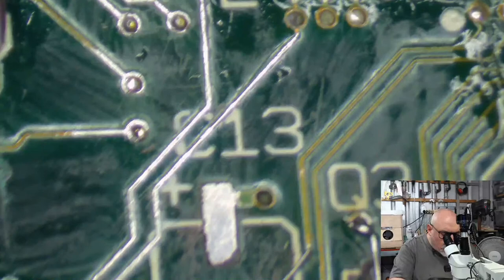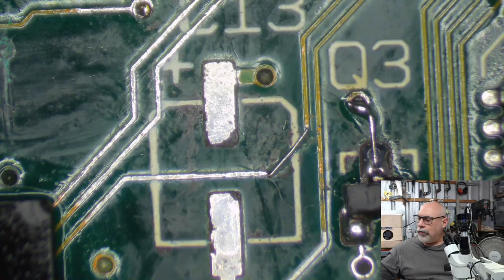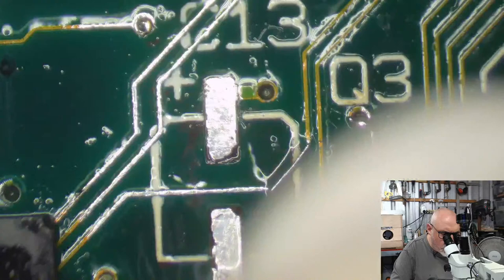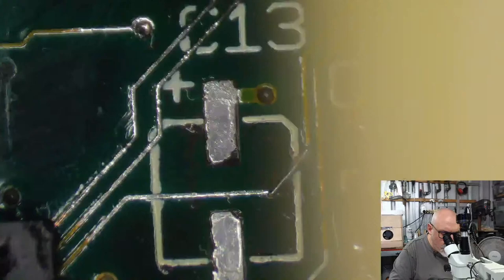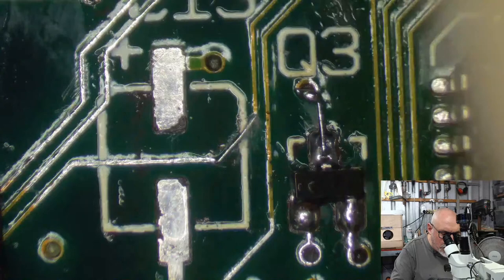the old classic and classic two, of course, they're in just such a terrible state at the moment in terms of capacitor leakage, and I just don't think a lot of people realise just how bad they are or the potential of how bad they are. And you know, people might buy one online and they go, oh, I'm all right. I can recap this. I've heard about recapping. And then they get it and they find out that it's just a mess. They've got to recap the logic board. They've got to recap the analog board. The analog board might be damaged from the capacitor leakage. And they need to be cleaned. If the analog board hasn't had all that electrolyte cleaned off, day one work.